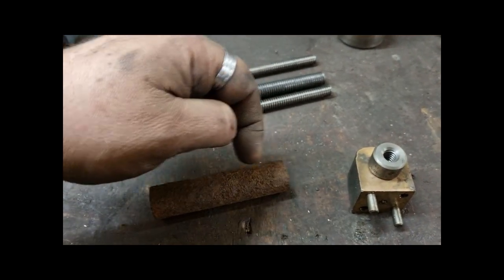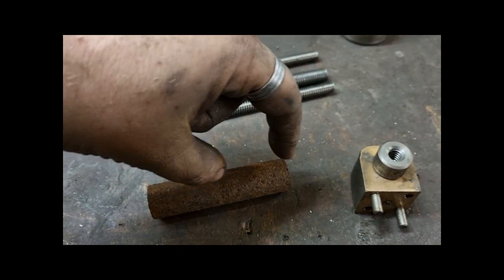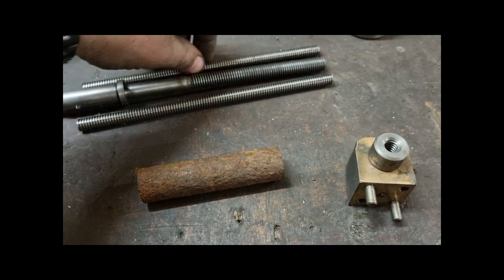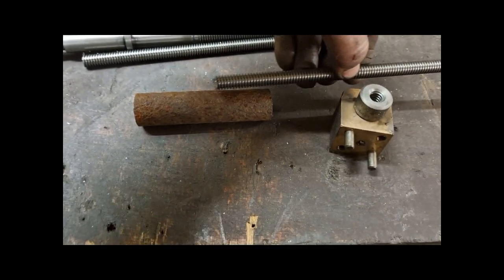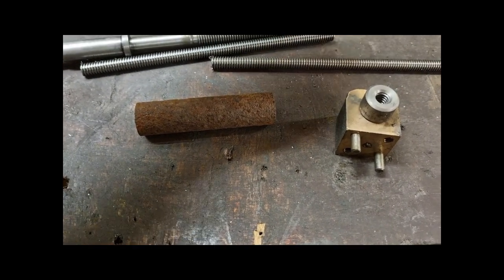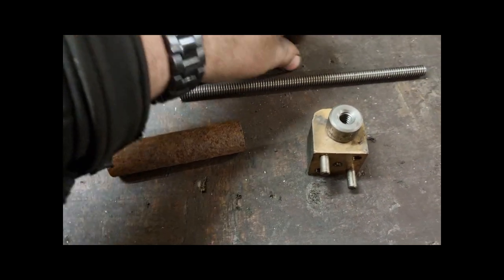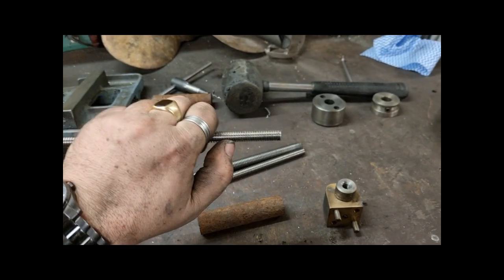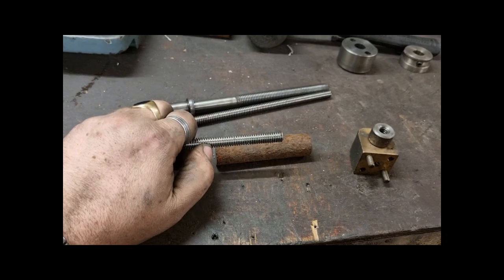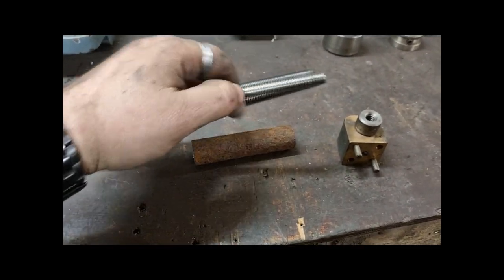Drill and ream to 10 millimetres, for about 40 millimetres diameter, length, for this to push into. JB weld plus pin it, and then when that's set, come back, hold the bar in a collet chuck so that's then sticking out, and then turn the OD how it's supposed to be.